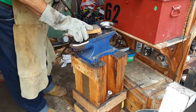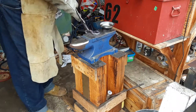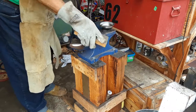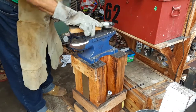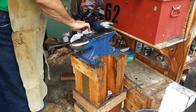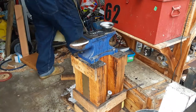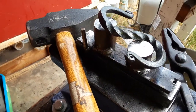From there it was just refining the profile so that it's nice and square, and then brushing it to get off the scale from the previous heatings. Off to the right is a little metal bowl with a magnetic base filled with canola oil, and that is what I used to finish the S-hook. And here is the closest thing I can get to a beauty shot — enjoy!